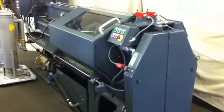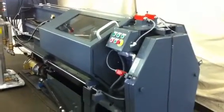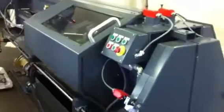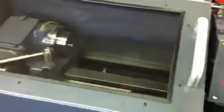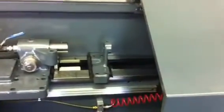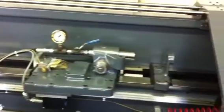Pratt & Whitney half B30 deep hole drilling machine, rebuilt and retrofitted with ball screws and servo motors by L.R. Brown in 2013. This machine is rebuilt from the ground up, mechanically and electrically. The bed is ground scraped, all the slides are remachined and scraped in line with each other, with an automatic lube system and new wipers. A ball screw and servo motor replace the original rack and pinion feed, and new spindle bearings are installed on both the chip box and the main drive spindles.